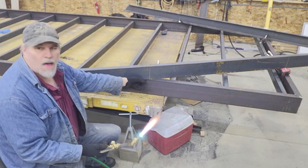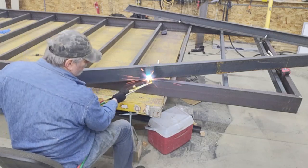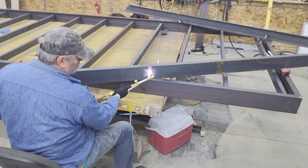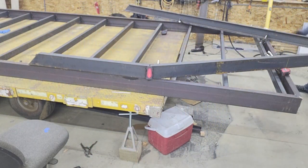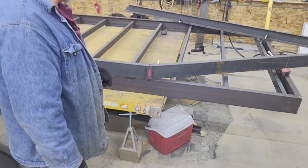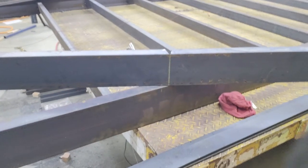Too much noise in the background, so I'm just going to get it ready to hop there on the line and then push on this thing. I've got a clamp so the other end doesn't move. Let me grab one more clamp and clamp it down flat. Moving over to the other side for a closer view — you can see that gap closed up almost perfect. There's maybe a 32nd of an inch there, which would be perfect to get good welding penetration.